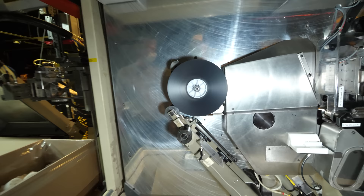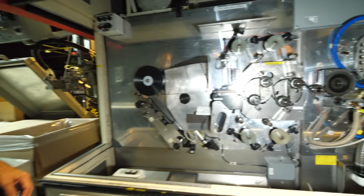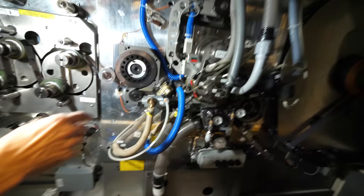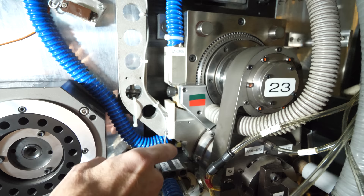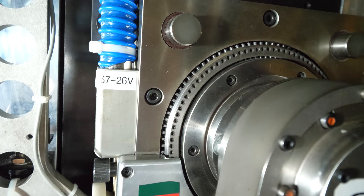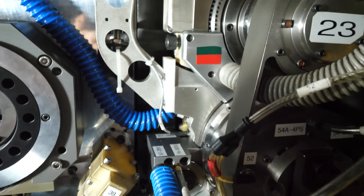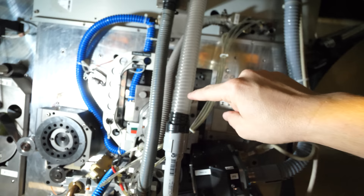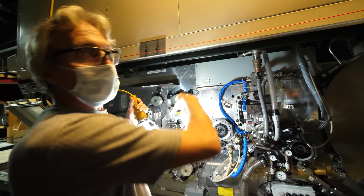Can you show me where the holes are being punched? This right here is the actual punch drum, and this is the die drum. As it rotates, it's pushing the perforation — you can see the little posts punching the holes in the film right here. The film pieces that are ejected go into the heart and get vacuumed out. If I had a high-speed camera, I'd see little holes of film going that way through the vacuum. Is there a bucket of those holes somewhere? Right around the wall — there's a big bin.